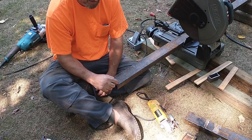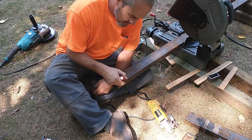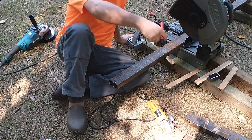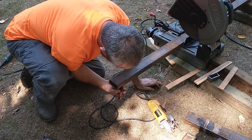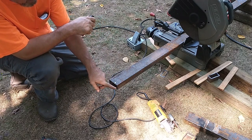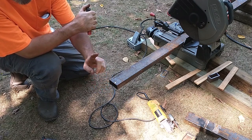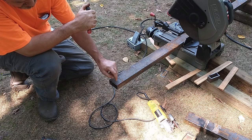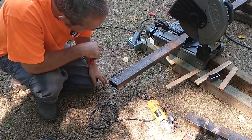This is square. I'm going to cut the first one of these and mark it out. I know I ramble a lot — this is all off the cuff. I know I have to come in two inches, but because this is a quarter-inch roundover and it's three-sixteenths, it'll make it kind of hard. Why do I say it's a quarter-inch roundover? Because this side is one-eighth and this side is one-eighth, and when you add them rolling together it's going to be approximately what the two sides add up to. Otherwise you end up with a thin spot in your metal right there.